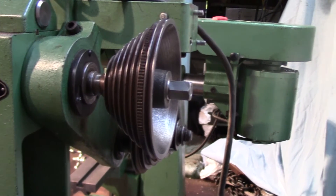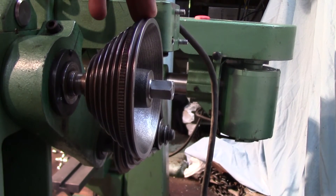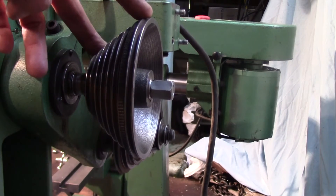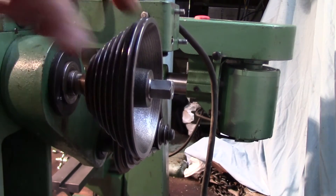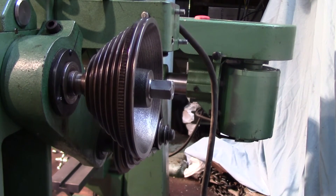Here's the drive pulley. You can see there are eight speeds on these pulleys, with little tiny grooves that use a belt about a quarter inch wide at most. The idea was to get a useful number of speeds in a small amount of space. There are no back gears — this one does have a countershaft for speed reduction, but it's a single speed between the countershaft pulley and the motor, and then eight speeds on the step pulleys themselves.